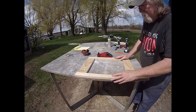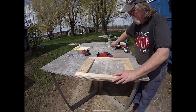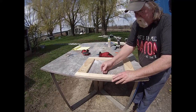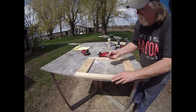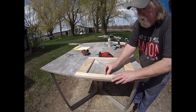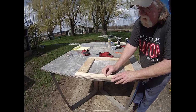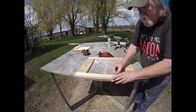Now, before I put this together, the way I want to attach it to the cabinets is going to be glue and then screws to hold it. But these, I'm going to use the same screws I'm using for the pockets, because they have a nice flat head, a good strong hold. They don't go all the way through. So in order for me to have this go into that 3/4 inch plywood, I need to drill a countersunk hole